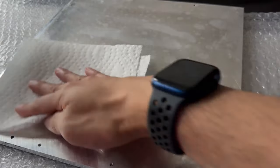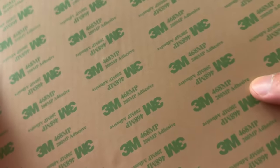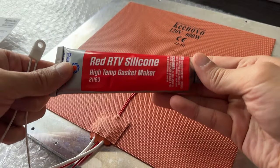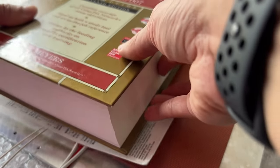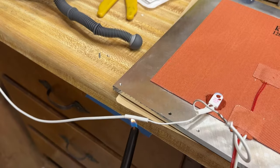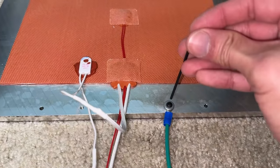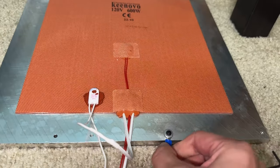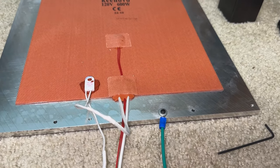I recleaned the surface and note this heater pad has a different type of adhesive — I'm going to install this dry. Using high temp gasket maker, I add a thermal fuse to the pad directly and put some weight on it for 24 hours. I soldered the fuse and heater wires, both of which are supposedly 18 gauge. For the ground wire, I decided to use 16 gauge wiring, but minimum spec is 18 gauge. The ring terminal is also not included in the sourcing guide, so make sure you buy some.